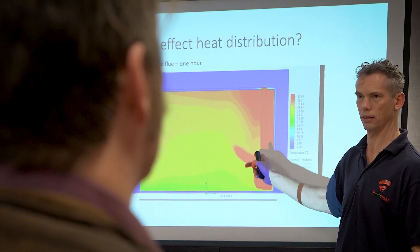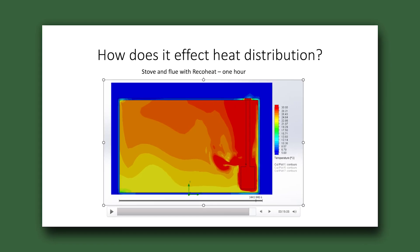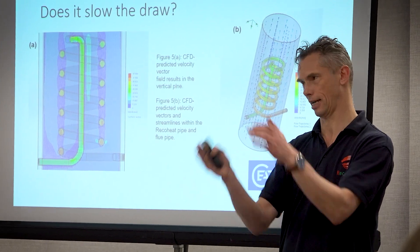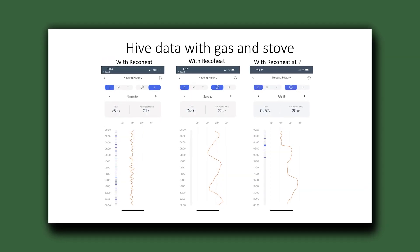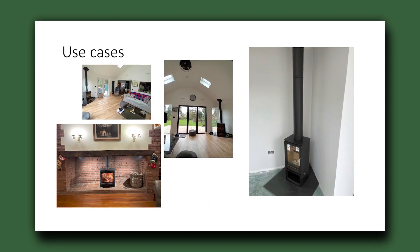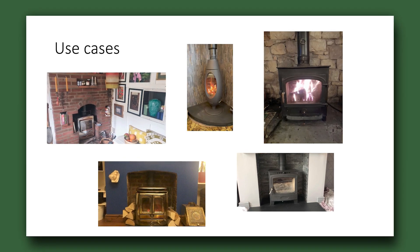The jet of air comes out really hot and it's turbulent air. It picks up the radiant heat from the stove really efficiently and adds that to the flow. But then when it hits the cold air in front of it, it destabilizes the jet, and the jet starts to oscillate — it's like a big spoon stirring the hot and the cold air together. On the engineering modelling running a physics engine that we were doing, it heats a room in ten minutes that would take the stove an hour to heat. What you get is a much more even temperature across the room. Then you open the door and let it gush out and set up convection flows around the rest of the house. That's how it achieves it. It's pretty weird stuff.